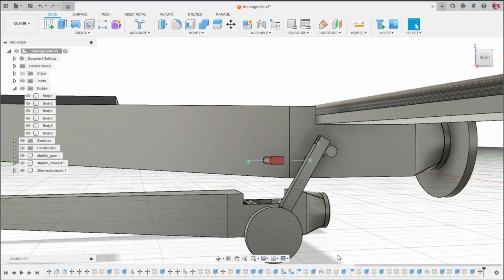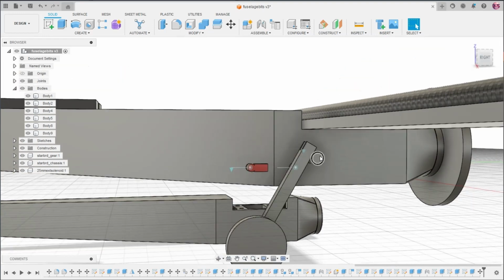Essentially, this is meant to be actuated with a solenoid so that you won't need a big, heavy servo. And it's meant to take all the strain off of the actual device itself when you're landing. When you stall on final approach and hit the ground, basically fall onto it, like half of RC pilots do for some unknown reason. Anyway, all your force is going to get pushed onto this pin here, which will presumably increase the life of this solenoid.